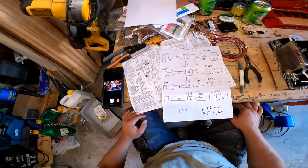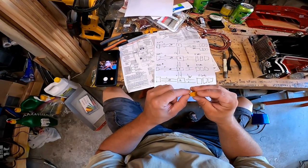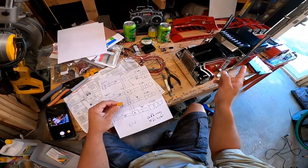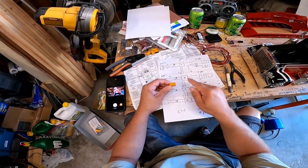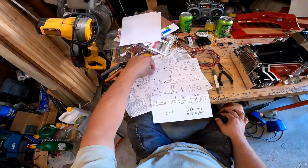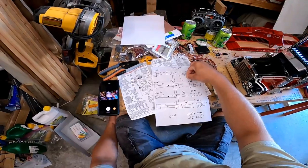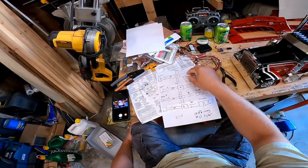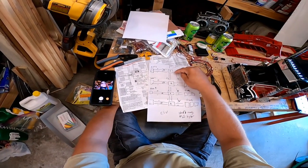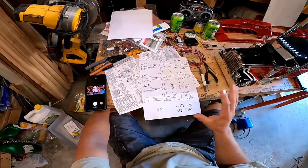On the circuit board, there's going to be a relay at each one of those. So it goes in and tells it I'm on, and opens power. Then I'm going to have my power coming in from my BEC, and when this turns on, it flows out through my circuit card to my contacts. For my running lights, since they're all going to be running lights, this one is in turn going to feed all the rest of them too. I'll put a resistor for each pair of LEDs on the board, because I'll explain that in a little bit, and then it'll run to each LED. This will then continue on with a diode to all my other circuits, so that they will all light up, right?